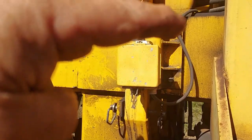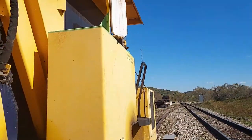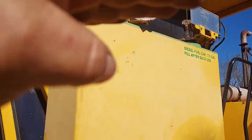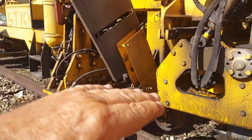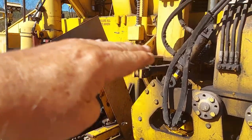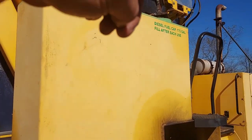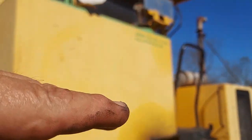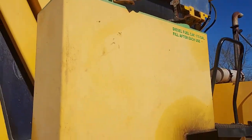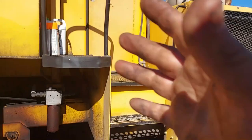This transducer right here goes up and down with the track deviation. If we come to a spot where the track is high, it's going to shine light into the top of that receiver and say no jacking is necessary. But if the track surface is low relative to where I have my light set, the light beam is going to go into the bottom part of that receiver and tell the machine to jack the track up until it hits that middle photo cell, which zeroes the voltage out. That's a simple explanation of what happens on the outside with my lining and surfacing.